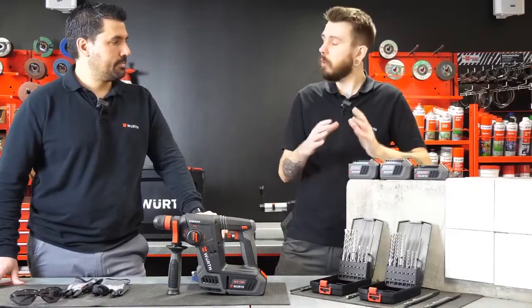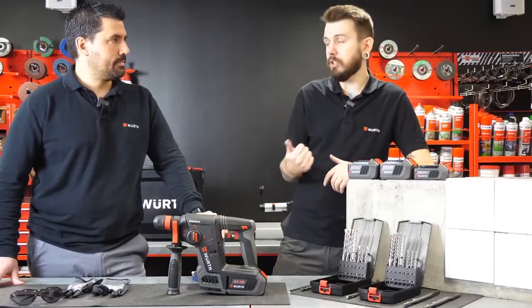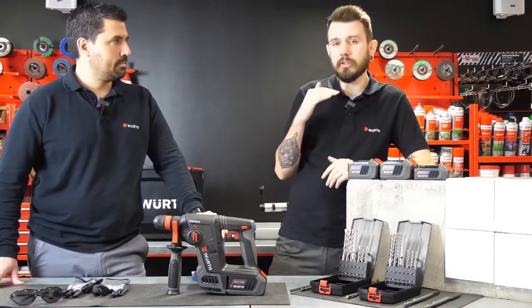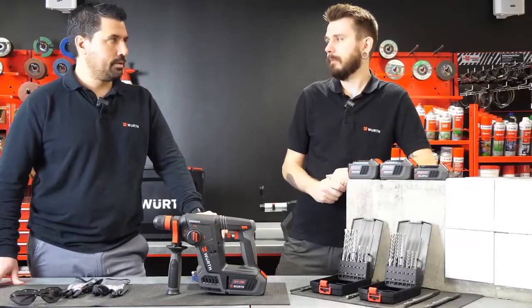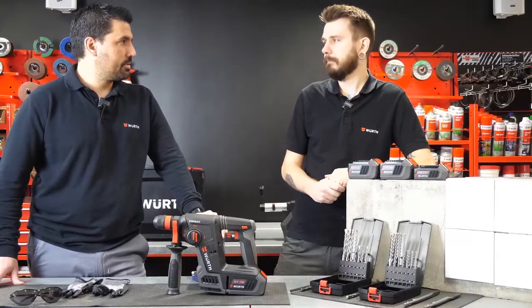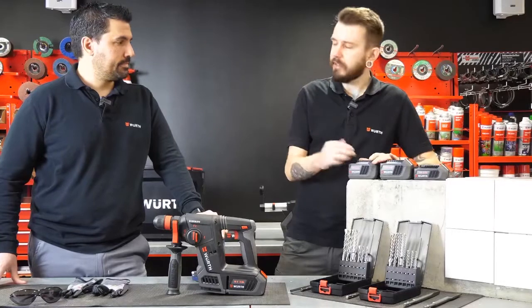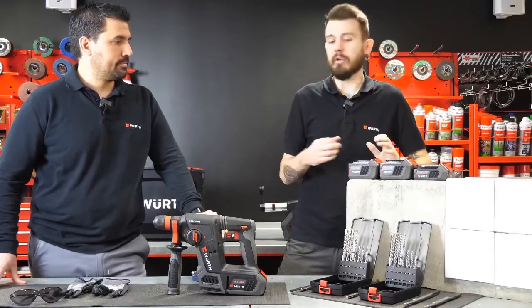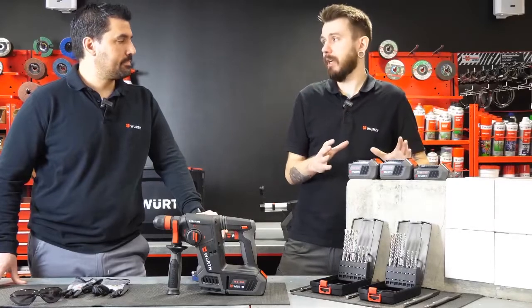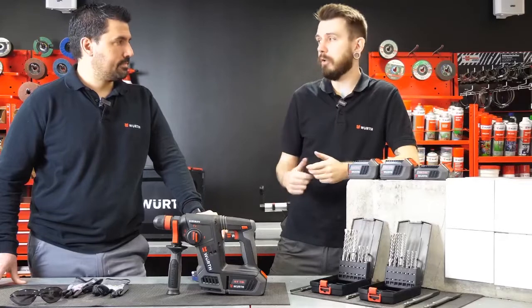Yep. And it also works hand in hand with the motors in our system, giving them additional protection and making sure they receive a consistent voltage. Brilliant. Yeah, because voltage drop is what destroys not only motors, but batteries as well. Exactly, and inside the battery, if one of the cells inside gets damaged, you effectively eliminate the entire battery. So having a really good protection system around that means your batteries are going to be running a lot better, they're going to last longer as well.